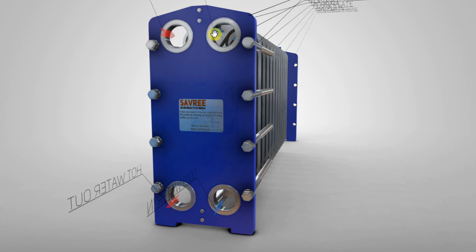So if we're pumping fluid around the heat exchanger, it makes more sense to pump it in at the bottom. That way, as it gets warm, it's going to pass up anyway and then out of the heat exchanger. If we did it the other way round, we'd be pumping the fluid in cold, it would get warmer and want to rise back up as its density decreases, and we'd have to put more effort into pumping it down and out. So as a general rule, a cold fluid going into a heat exchanger goes in at the bottom and out at the top.